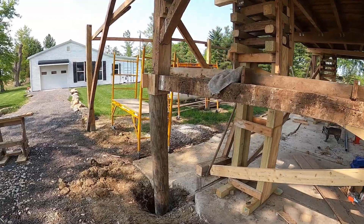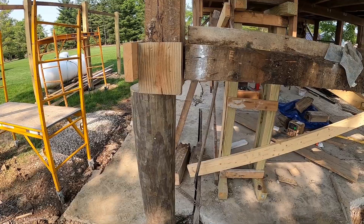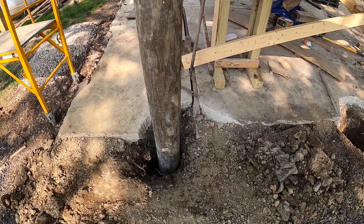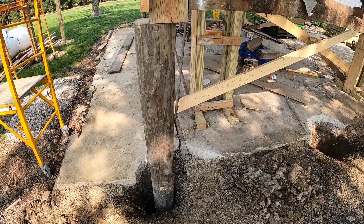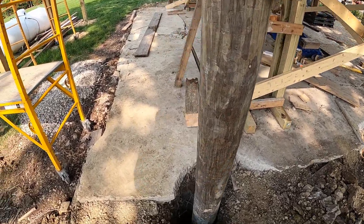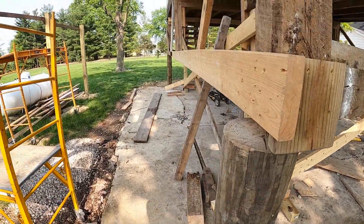We've got another telephone pole here. Now these telephone poles are just sitting there right now, so if they look out of plumb to you, that's a good possibility. But the holes — we dug them four foot deep and we put about eight inches of concrete in the bottom of the hole, and we used a 12-inch auger, so there's a pretty good pad down there.